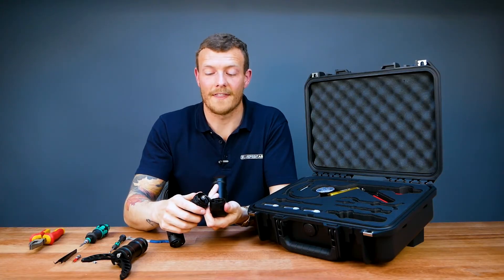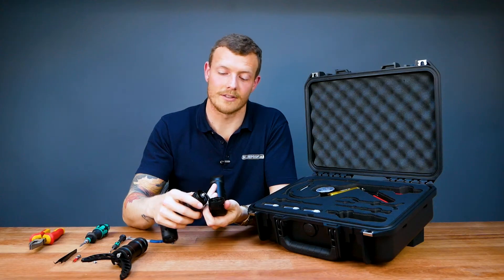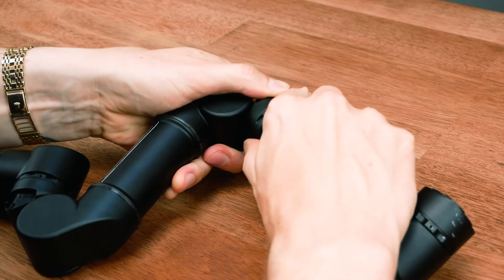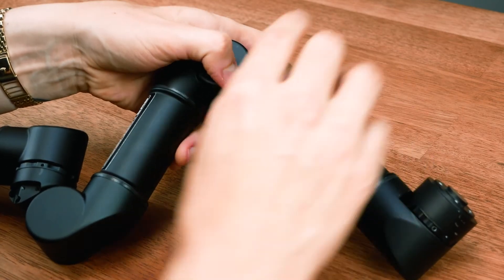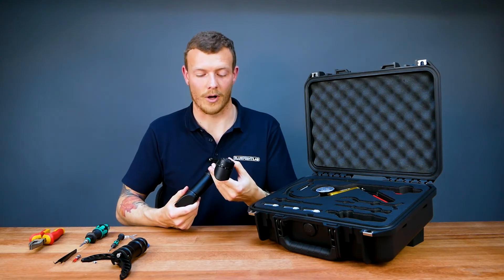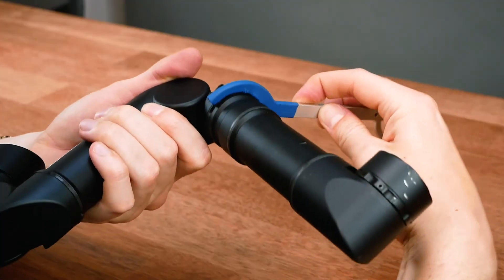The slots inside the housing will show you the alignment of the final module — take note of the alignment of those slots. Push the two modules together until the gap is closed, then rotate 45 degrees allowing some pressure to start coming out until you feel it click into place and a gap reappears. To double check alignment, connect through to Reach Control and compare the final product to the 3D render. Then retighten the bayonet and insert the grub screw.